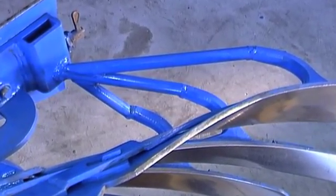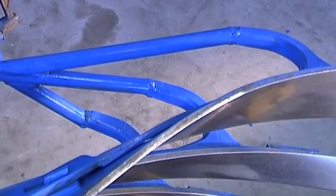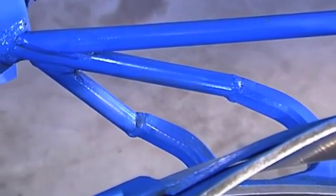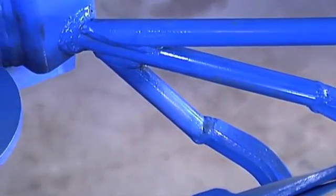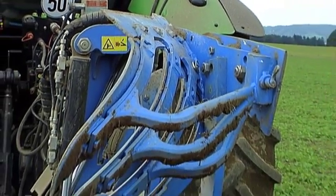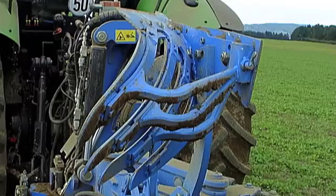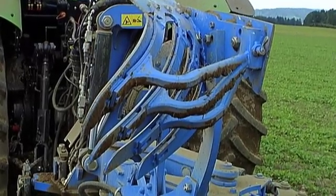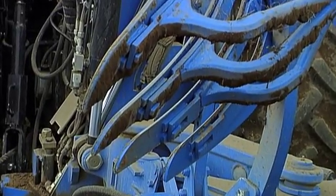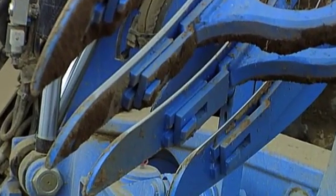At the same time, the mold boards and slats are no longer part of the permanent construction, but rather attached replaceable parts that can wear out completely without jeopardizing the stability of the plow body. With the new Duramax generation, the mold board slats and mold board shin are fixed to a separate bracket without securing bolts — they are hooked into the bracket. Mounting parts subject to wear have thus been eliminated, meaning the service life of the wearing parts is no longer dependent on the limited life of the securing bolts.